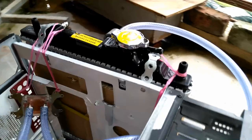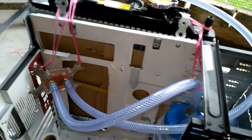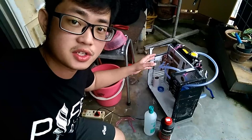We are going to wait for a few hours. We're gonna speed up the progress today. So no leaks, zip ties and motherboard on. Switch on the system and check temperature. Alright, hours after, the pump is still running, no leaks, all fittings good. And I'm gonna stop the pump right now and drain the entire system, fill it with distilled water and coolant. So let's get started.